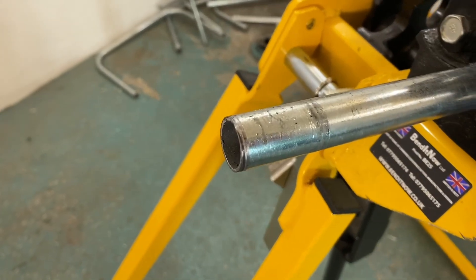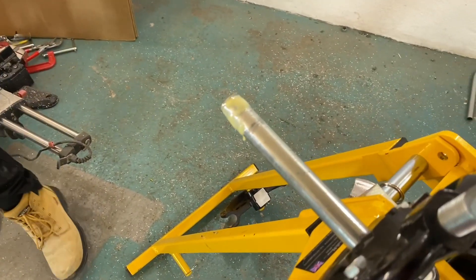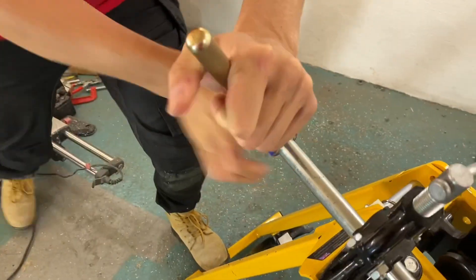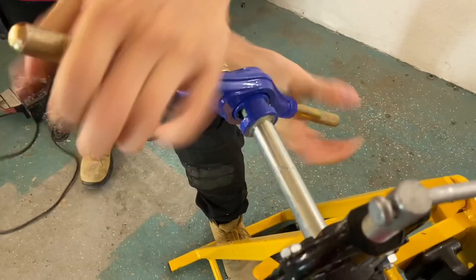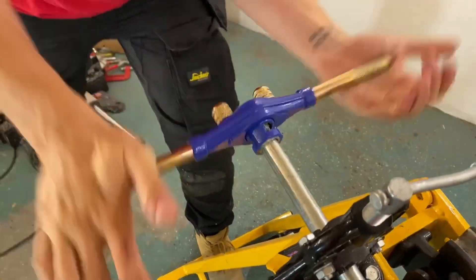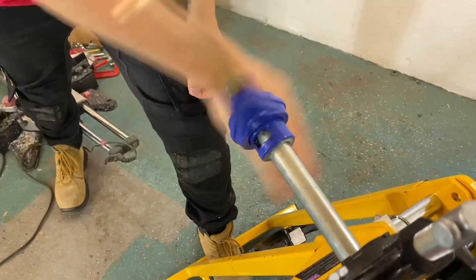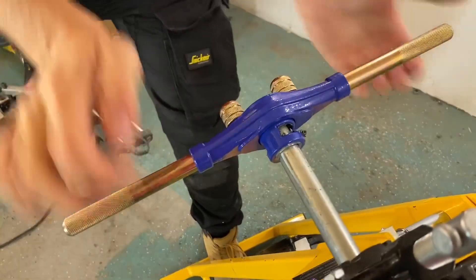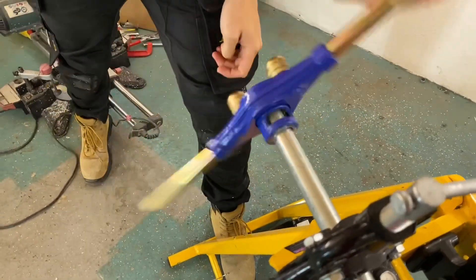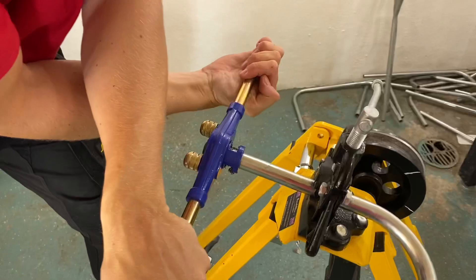Now you're going to bring your cutting compound in — not going to use that tallow, was it beef dripping? Yeah, that's right. So now we're going to thread this one up — looking good. This is about three or four turns and then we go back again to clear the swarf — you may see little bits go off. We've done a separate video on just how to thread steel conduit, so this is following on from that. You can see the swarf just dropping out there — if it stayed in there it would create a bad thread and actually break the thread. So we don't want that. How many threads do you like hanging out the back? I'd say two or three poking through — which means we're about halfway through a coupler. I'm happy there.